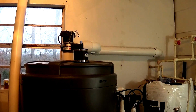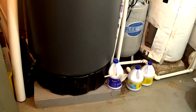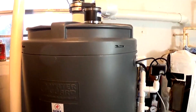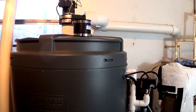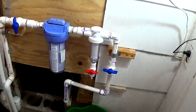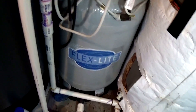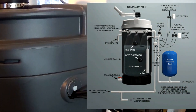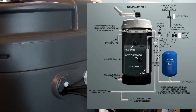You might have heard the fan blowing outside — that's because this tank here is constantly being vented. I can't open it up for you at the moment, but you can take my word for it. This is a water aerator system. My water comes in down here, comes up through these two filters, comes across there, comes down here, and comes up this back side right here. It goes into the tank, and inside the tank there are six or eight aerator spigots, circular. So when the water comes in, it's actually being fanned out.